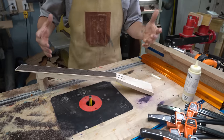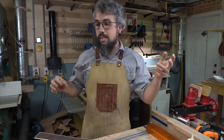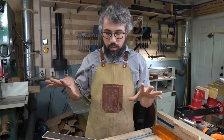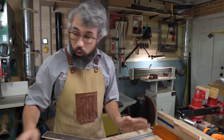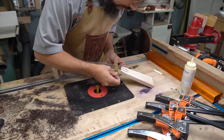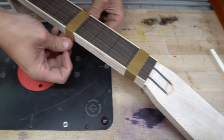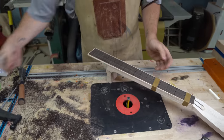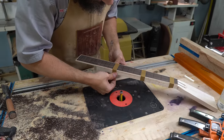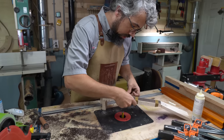So here's what I do. Obviously if you were to just put some clamps on here, it's going to slide all over the place. In an early episode — like in the single-digit episodes — I talked about using table salt, sprinkle some salt on here so that things don't slide around. I've abandoned ship on that method, especially for this particular spot because I don't want to have granules of salt showing. So in order to keep this from sliding around, what I like to use is some binding tape. I very carefully get this right where I need it, pushing down with good pressure and getting it in place. By wrapping it around both sides, it's going to keep it from sliding left-right as well as forward-back. You notice how I'm not in a crazy hurry — by going a little bit slower, it's going to let the glue set up just a very little bit and help keep it from sliding around.